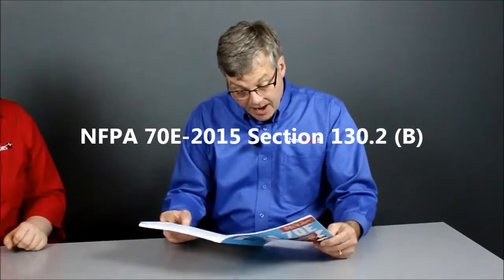Certainly I can answer that. It's spelled out pretty plainly in NFPA 70E, the new version, in Section 130.2B. They have two requirements — two certain tasks that might require an Energized Electrical Work Permit. Number one is when the work is to be performed within the restricted approach boundary. That is one of the two shock boundaries, and if you're going to go past that boundary, then you need that Energized Electrical Work Permit. The second is when an employee is going to be interacting with electrical equipment in such a way that they could create an arc flash accident themselves or that there is an arc flash hazard to begin with.